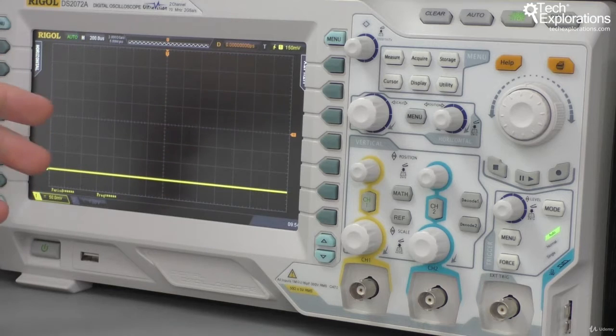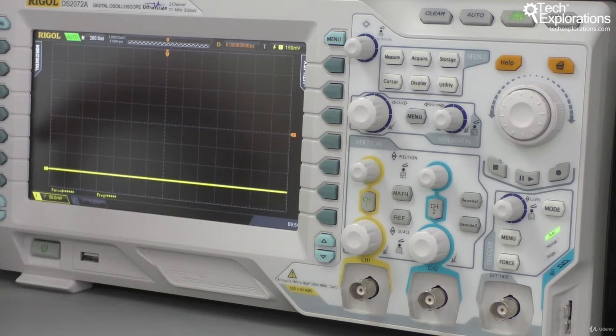In my case, I'm going to show you how that looks like on this particular oscilloscope. One thing to remember is that before you invoke this self-calibration routine or process, you should turn on the oscilloscope and let it run for about half an hour so that all its internal, especially analog electronics, become warm enough to the temperature that is appropriate for its operation. So it's not too cold, for example, if you just turn it on and go straight into doing a calibration. So turn it on, let it warm up at its normal operating temperature, and then go ahead with the calibration